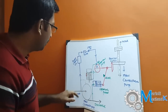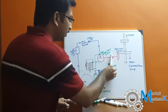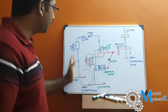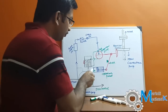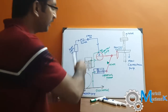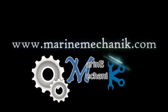To summarize: if there is no water pressure on the discharge side, the spring force engages the friction clutch via the lever, causing the air extraction pump to rotate and suck all air from the casing, discharging it back to the tank. When the centrifugal pump gets primed, the discharge water pressure acts on the piston, pushing it so the lever disengages the drive and the air extraction pump stops rotating.